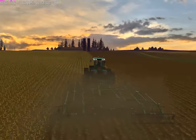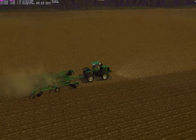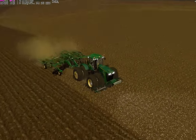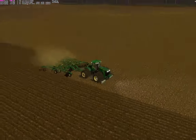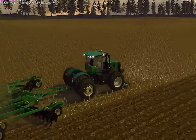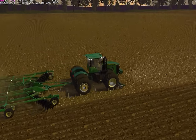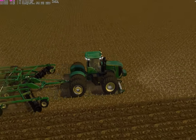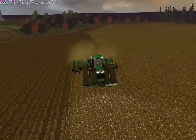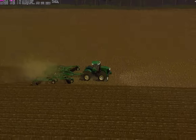And with these shanks, these rippers in the middle, they really slice through that compaction layer to help with water absorption, and really with root germination as well. Because if you know anything, water will seep right through sand, it won't stay, whereas clay is basically cement, and water won't absorb. So you want a soil that's in between, that can absorb water from runoff, absorbs all that moisture, and doesn't run off and erode. And you don't want it completely sandy, so that you actually retain that water.